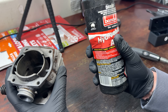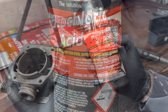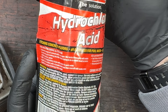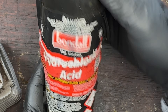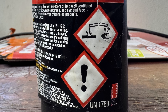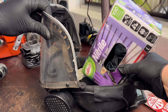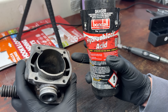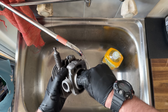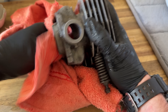One more method you can use — but you have to be really careful — is hydrochloric acid. It's amazing in that it cleans the transfer off in just a few seconds, but it's caustic to skin, so you have to wear gloves, a mask, goggles, and ensure good ventilation. For this to work effectively, you have to fully degrease the cylinder first and then make sure it's dry, because you don't want to dilute the acid.